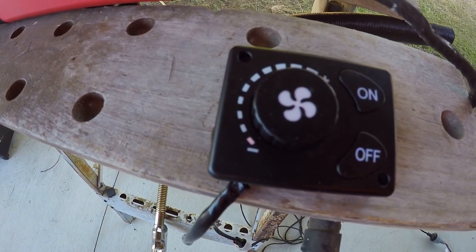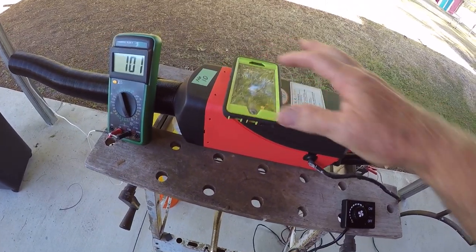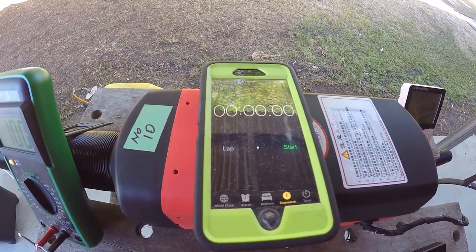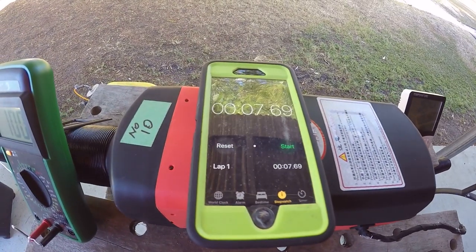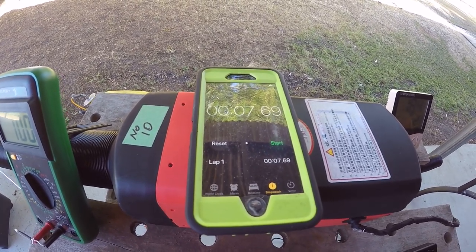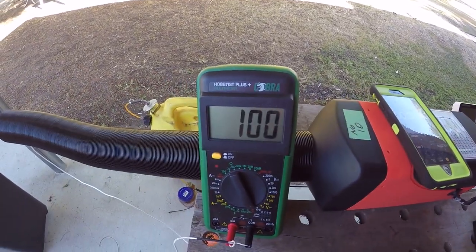The little heater has stabilized on one bar on the manual controller. We're drawing about 0.5 to 0.6 of an amp at that low speed. At this low speed it's easy for me to count the pulses on the fuel pump to determine the hertz rate. I've done it three times: counting for a minute then dividing by 60 gives me 1.6 hertz, which is very similar to what other standard controllers do. Temperature increase is good — from about 18 degrees C up to 100 degrees C.